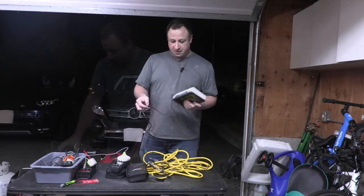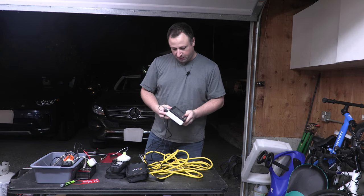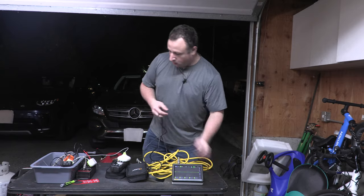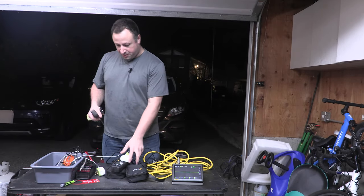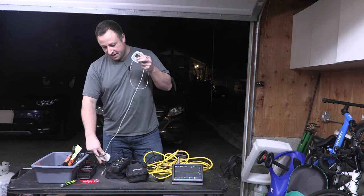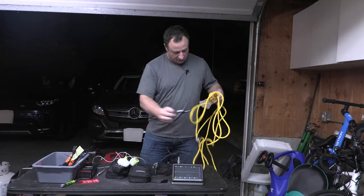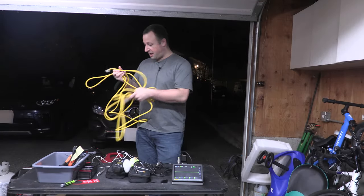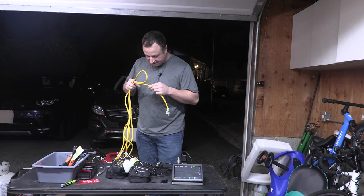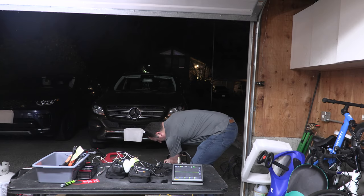So our standard fare is going to be the gauntlet, so we're going to take our oscilloscope, which is still working, and we will be looking at its waveform both at idle and under load. We also will be able to apply some load with our amp meter here, or I guess we can probably just use the Belkin more easily, and so we can get an idea of what kind of wattage we're pulling. We will be using the extension cord three-way adapter, which is fine for this application, but whenever we do our heavy load testing it's going to be a no bueno. This is a 14 gauge wire, so not great, but at least we're not at an 18 or something.